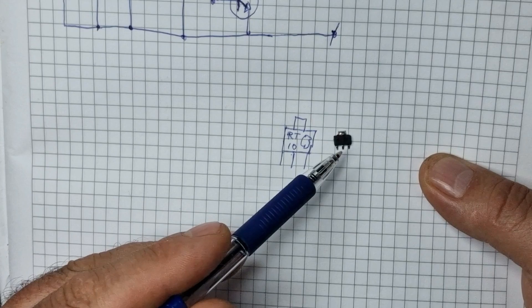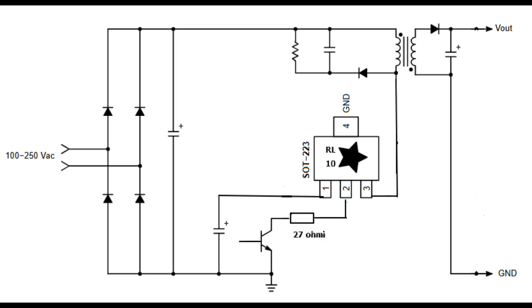The faulty component does not appear to be a MOSFET, since it is labeled N on the board, just like the other integrated circuits. Essentially, it is an integrated circuit that directly controls the chopper, similar to an LNK304. I have created a schematic of the faulty integrated circuit by tracing the board. Now I will need to find an offline switcher IC that performs the same function, which is quite a tedious process.